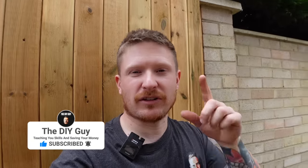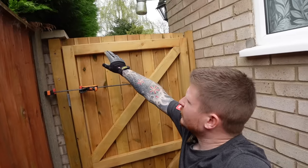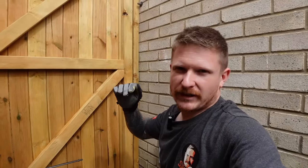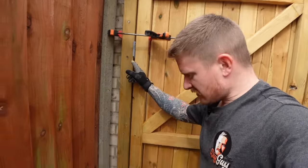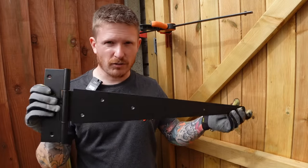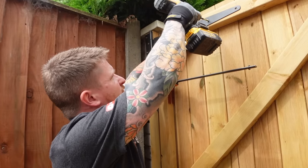I've lifted the gate into place. The 50mm overhang at top and bottom gives a perfect finish so the post height finishes in line with the cladding — you can see that on both sides. I've sat the gate on two offcuts of cladding to get the perfect gap at the top and bottom, then clamped it in place with 10mm spacers at each side, allowing the gate to sit in its final position to fit the hinges. We've got two heavy-duty 500mm T-hinges — don't buy cheap ones, get a good quality heavy-duty one. Fit one at the top and one at the bottom with the small gold screws. Take the clamps off and the gate shouldn't go anywhere.